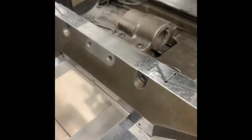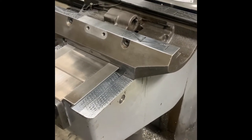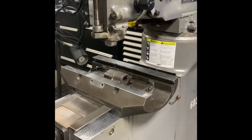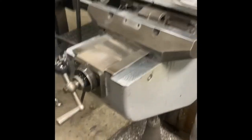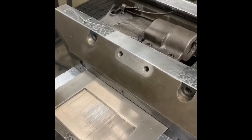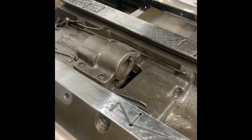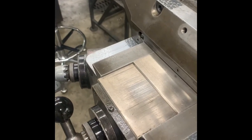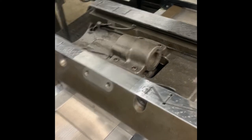Now we have the saddle on and the Y axis assembled. Let's talk about backlash. On the screws and nuts on a service job — I've standardized what a serviced machine means. Basically, if the machine has full smooth travels without getting tight on either end and I can maintain less than 8 thousandths backlash in the middle, it does not get new screws. If it's more than 8 thousandths in the middle — like 10 or 12 — even if it's smooth on the outsides, or if it gets up to 10, 12, 15, I replace the screws and nuts.